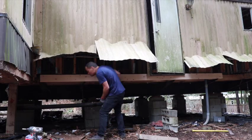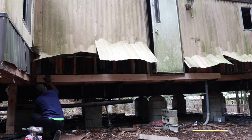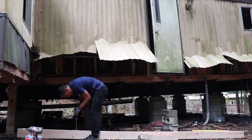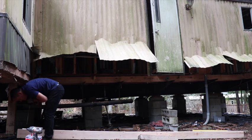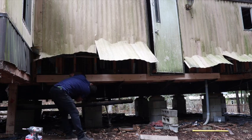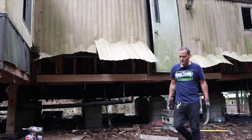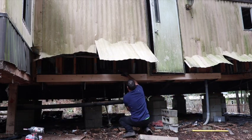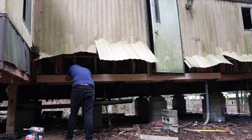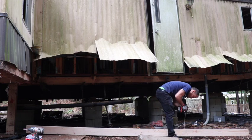Here's the 14-foot board getting put in. I just mark the first two sections, pull it out, and complete the drill through on those as you've seen before. On this one I put the carriage bolts upside down halfway up in there just to stabilize it, then use my drill bit and go halfway on this one. Then I'll mark the remaining two since it's lined up well enough, take this down, finish the drill holes — and it lines up pretty good. I didn't record the final board because you guys have seen plenty of this, especially if you watched the other episodes.